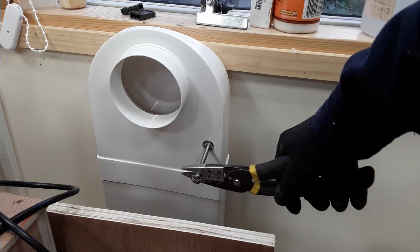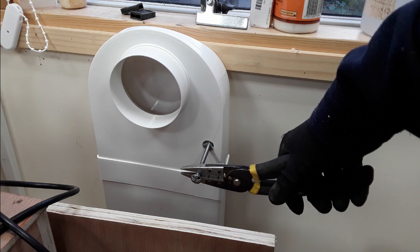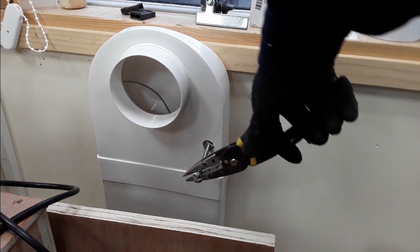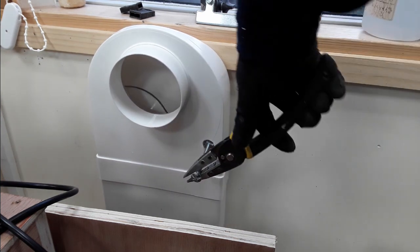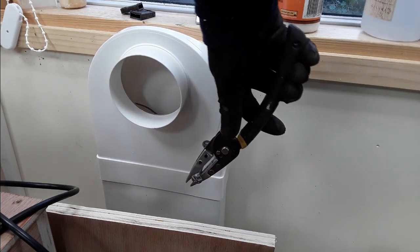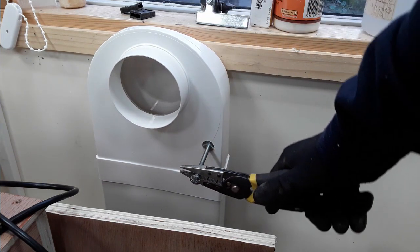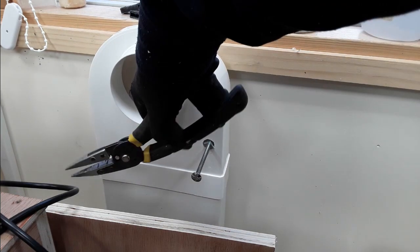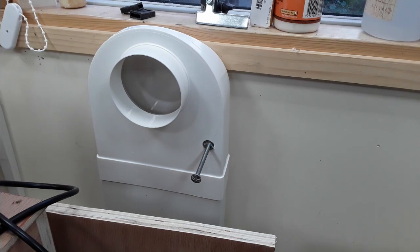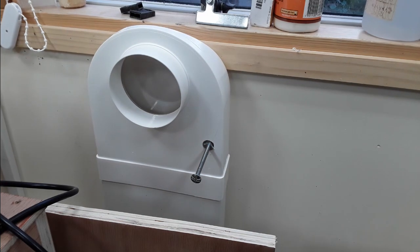So that's the gate in operation now, in place as the Mark 1, and as I say, until I get the cyclone working it's difficult to know how it'll perform, but it certainly seems to be easy enough. I'll just put a knob or a handle onto that arm, and it needs a couple of stops to stop it going too far back either way, but that'll be open and it gives you a clear 4-inch opening, and that's closed and that shuts it up fairly flush. I don't think there's going to be a lot of air leakage there. It's got retaining behind the perspex so it won't get pulled in, so I'm hoping that will be a successful operating gate, but we'll try the first one and then we'll move on if that one's successful and put the other 4 in.